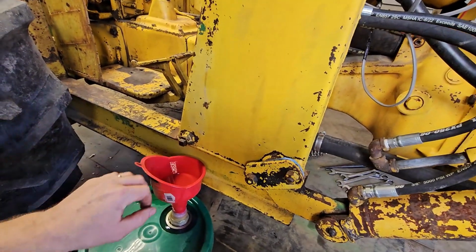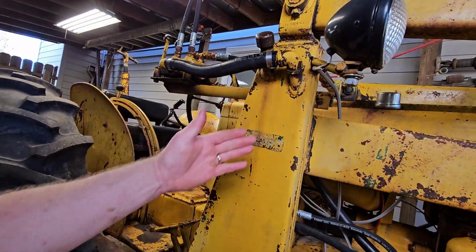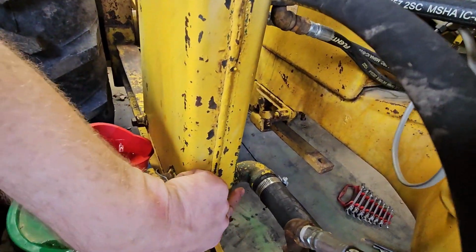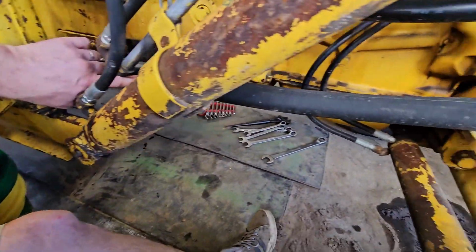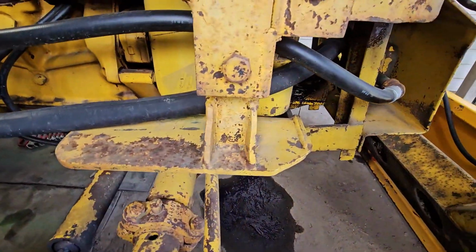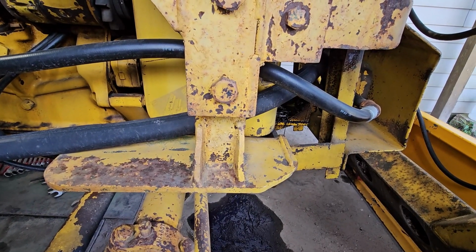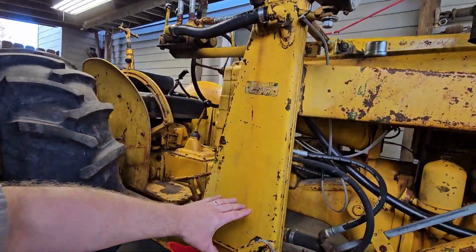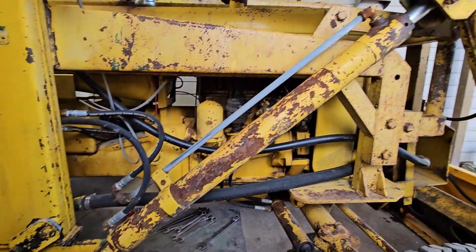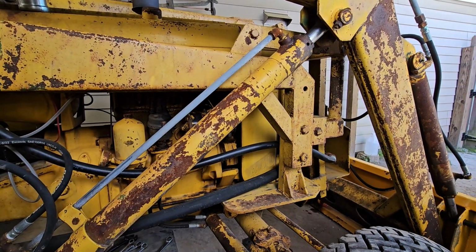All right, all the oil is drained out. I got the drain plug back in, and you may be wondering, why did I drain the oil from this tank? Well, if you look on the back side here, let's look through the hose here. This line at the bottom of the tank is the suction line that goes all the way forward to the pump. So when I disconnect the pump up there and take the pump out to disassemble, basically the gravity pressure from this tank will end up blowing all that oil out the front. And yeah, definitely speaking from experience.